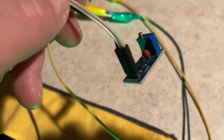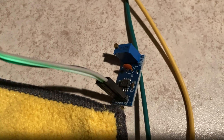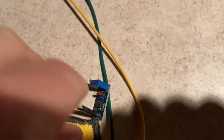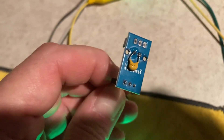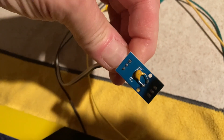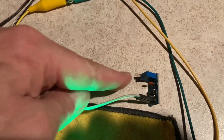That way it would slow it down, because this thing normally runs way too quick and too fast to flash an LED — you wouldn't even see the LED flash. So I soldered that 0.47 microfarad capacitor right there in parallel, and that slowed it down. Then I used the little potentiometer right here to pick the rate you want.